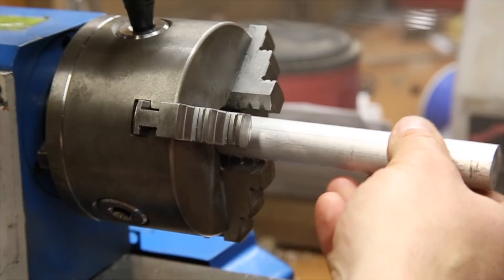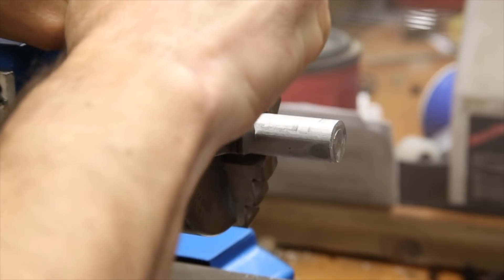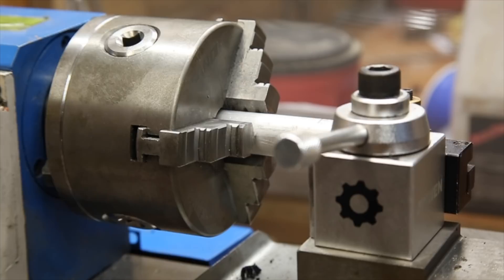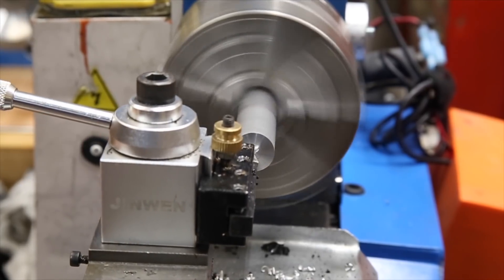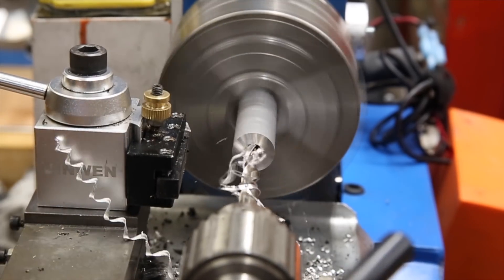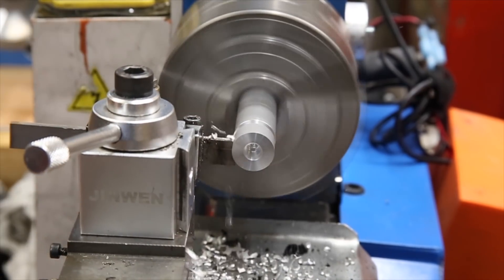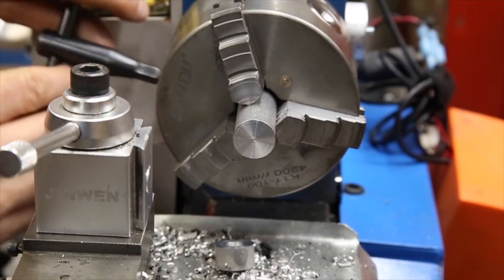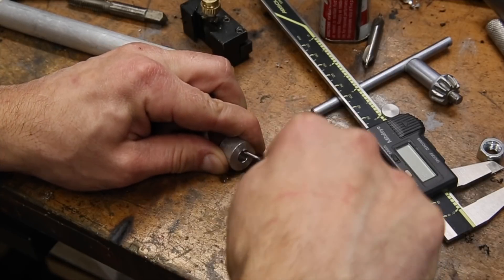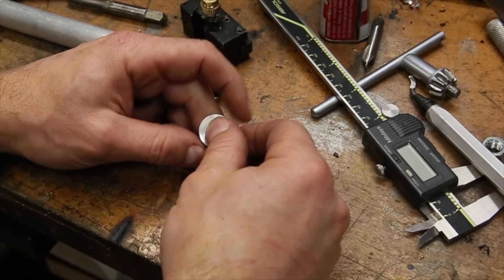To start off this project I need to make a simple jig to help me drill a hole in the center of the material. I don't remember where I saw this trick, but this is a quick and easy way to ensure a hole drilled perpendicular to the part is exactly centered. It is simply a small piece of stock the same diameter of the part to be drilled, with a hole the same size as the drill bit drilled in the middle. It's really easy to make an accurate version of this jig on the lathe.